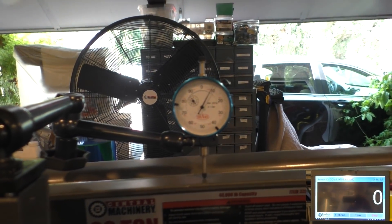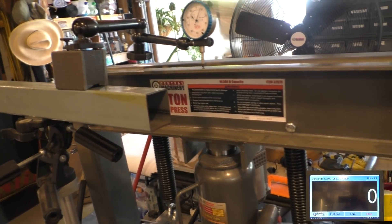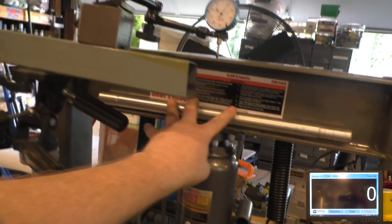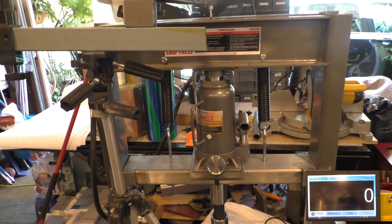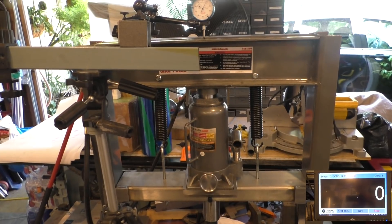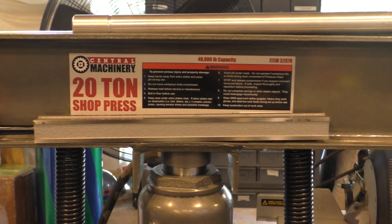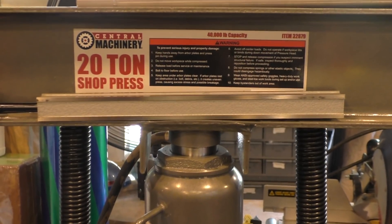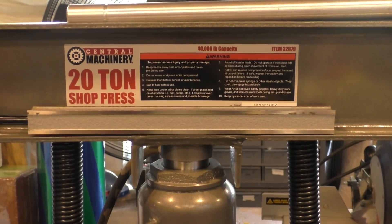When I release all the pressure — lo and behold, 8 to 9 thousandths of permanent bend in this guy. So this press really wasn't designed for the full 40,000 pounds for any amount of time. You can see the deflection now — I can illustrate it better by setting this straight edge on there. The Harbor Freight press is capable of 40,000 pounds for short periods, not long periods, because it tends to leak back. On top of that it is bending — they didn't make it strong enough to hold 40,000 pounds force for any real duration. I've taken it up to 40,000 pounds three or four times in preparation for this video. Take a look at the permanent deformation — that's a precision straight edge, and it was more or less straight when I got it.